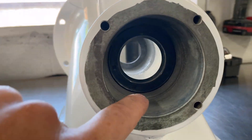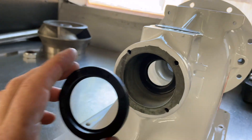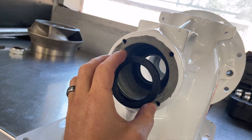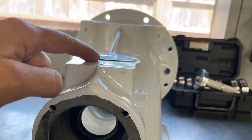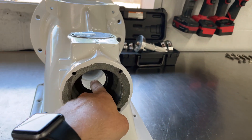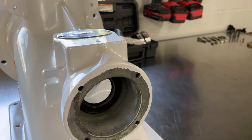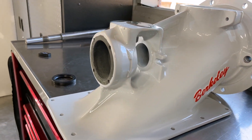That's a little unusual because it's purposely installed backwards in this suction housing, and this front seal is installed essentially in the same direction. The purpose of that is with the grease port — if we're greasing this and we over-grease it, it will purposely push the grease past the seal and not push the seals out. So it's kind of a designed safety measure that they built into this.